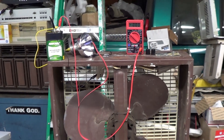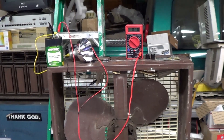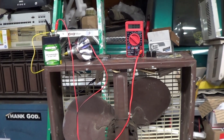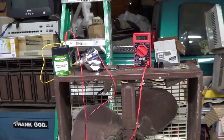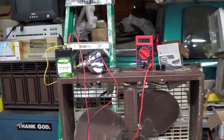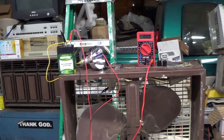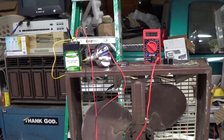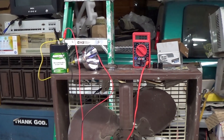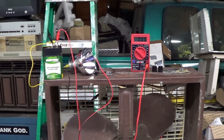I have to admit that I'm just doing this for fun — I wouldn't care at all about winning. In fact, I'm sure there are far better ideas that deserve the prize, such as the method that fellow YouTuber VWestLife came up with, where he decided to produce an audio cassette with music in one channel and a 60-cycle waveform in the other channel, repeated on a regular basis, so that as the music played through the speaker, the other channel of the amplifier, hooked up to an incandescent lamp, would turn on and off on a periodic basis, satisfying the requirements of the contest.